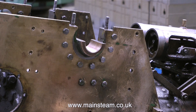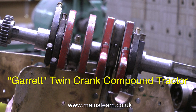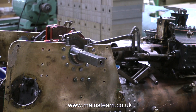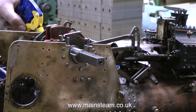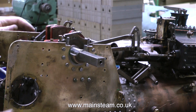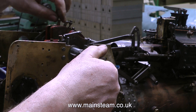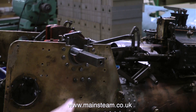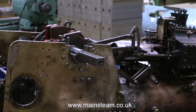In this clip I've just remounted one of the main bearing assemblies to the side frame. The official name for this traction engine is a garret twin crank compound tractor, so a good place to start is with the twin crank compound tractor crankshaft. The crankshaft of any steam engine is possibly the most important part. The cylinders are also important but they can blow and it will still run. If the crankshaft is not right, often the engine won't run properly, and if it does run it won't sound good. I'm very pleased to say this is a beautifully made crankshaft — in fact most of the engine looks pretty good — and my job at this stage is to make sure that this crankshaft runs in the main bearings with no slop and no tightness. If you don't get the crankshaft right the engine will never run properly.